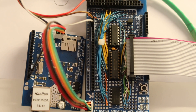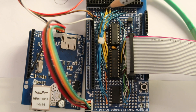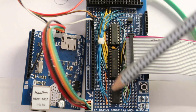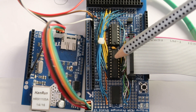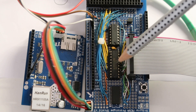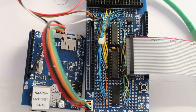That's all there is to it — it's a very simple design, although as you can see it has a lot of wires that need to connect the Arduino pins to the two chips, and then the two chips need to be connected to the HPIB bus. So it requires a fair bit of soldering.